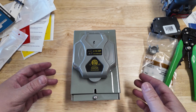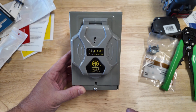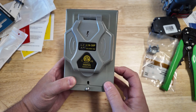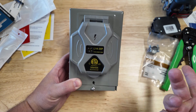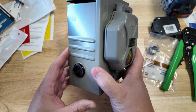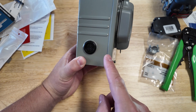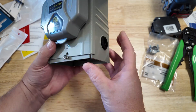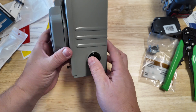Now that we have the hole in the stud, the next thing is to attach this electrical box outside. I particularly like this one because it's very heavy duty — it has good weight and thick steel. It has an electrical indicator light that turns on when power is going to it, so you know if the connections are hot and should avoid touching them. Some boxes have metal punches that are hard to remove, but this one has little rubber grommets on both sides, the bottom, and the back — making it extra easy to run the wire through.